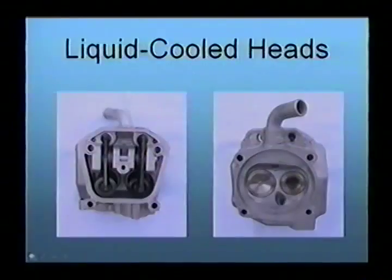The 9-series engine is unique in aircraft engines today because it has a unique combination of assets. It has liquid-cooled heads, which is relatively unusual. It helps us keep the temperatures stable in the head, and it enables the engine to resist shock cooling during rapid power transitions.